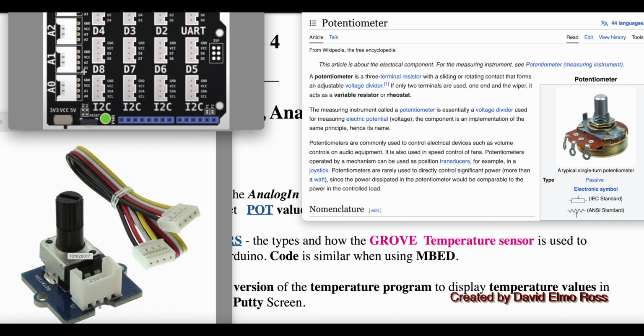When we hook our temperature sensor in, as you've seen before, it's going to use A0. So A0, A1, because each one of these, a temperature sensor and the pot, only take data in on the yellow connector, and that's where it's connected up.